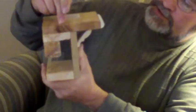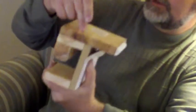And then we placed the hearth plate on top, which is a 1x6 6-footer pine, and a little small trim to set off the appearance with a little rounded bullnose attached to the edge to finish it off. Those are the basic structures and the materials that we use. We spent probably $250 on the product. With a little bit of paint, you have a very economical hearth put together.